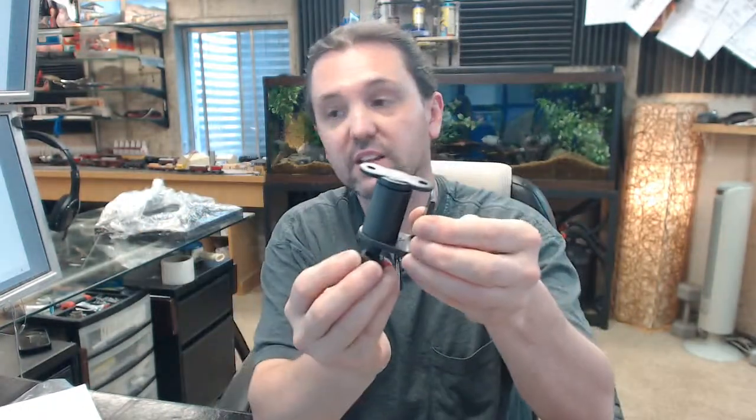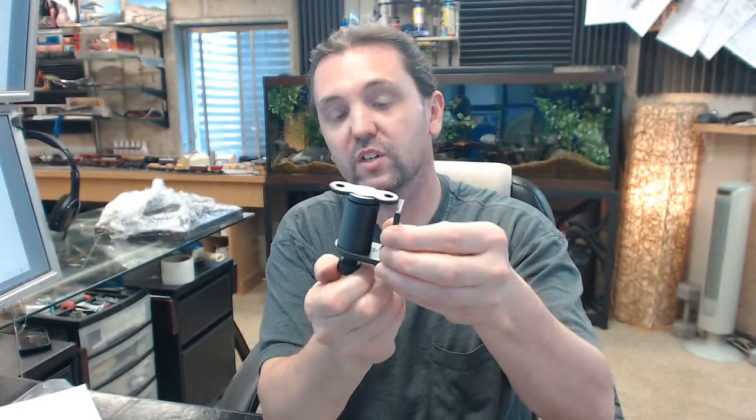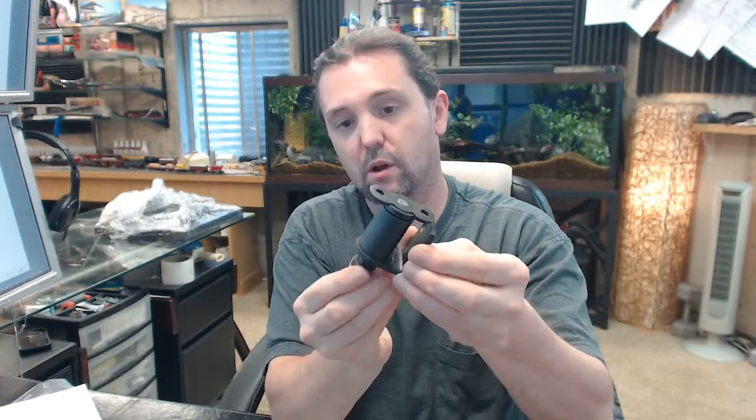So with the bottom pivot assembly actually installed in there, you can visually line up where this is going to be in line with or perpendicular to the back of the jamb in that star hole, and you'll be able to just get it down with your hand, then take the nut and, like they said, don't over tighten it. Over tightening it is simply going to damage the hardware. The hardware on the inside of this is not meant to have a wrench put on it and cranked down. It's not necessary. Just hand tight. That piece is never going to move.